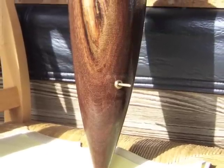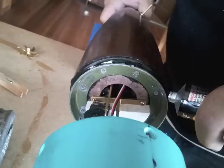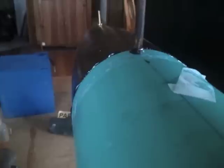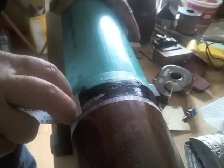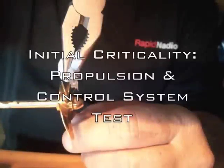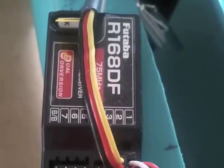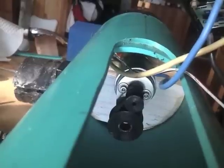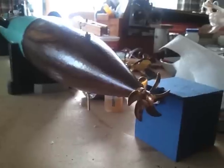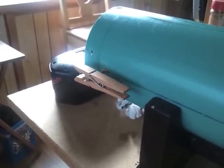The walnut stern section was treated with a brushed-on coat of polyester resin to prevent water intrusion. It was then mated to a flange fashioned from the top half-inch of an aluminum piston from an airplane engine, and secured to the hull with six screws and a generous amount of boat-life sealant. With the stern section installed, we conducted a propulsion and steering system test to ensure all components within the hull were properly aligned. After some tweaks, the propeller was turning freely and the rudder and bow planes were moving on command.